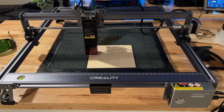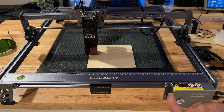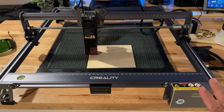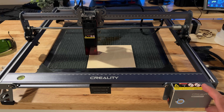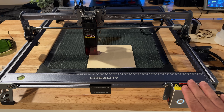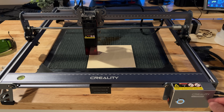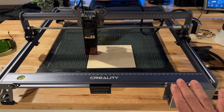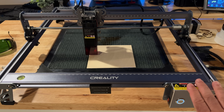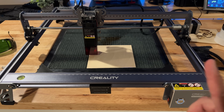Other things to highlight is the fact that you have this one-button-push module — this is the controller. You have a little flip switch to power it up, and then a button. The cool thing is that if you have a microSD card in this unit and it has a compiled file for engraving, it will allow you to — with a single button — frame what you want to see cut based on what's in the file. You only want to have one file in there. If you press it again, it will actually start the cut without any PC or laptop connected, which is pretty great. You only want to have one file on this.